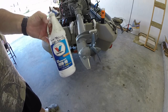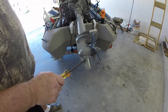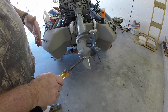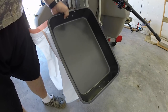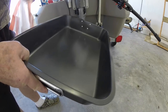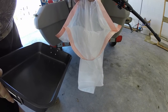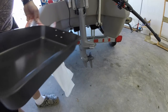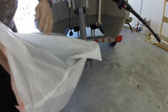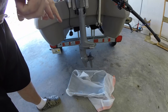Inside here is gear lube — that's what we're going to put in there. There are two screws: a top screw and a bottom screw. You need to drain this unit and get all the old oil out by taking both of these off and letting the oil drain out the bottom. I have a shallow pan that I use underneath the motor to drain the gear oil. To reduce cleanup, I take a 13-gallon tall kitchen garbage bag and place the pan inside it.